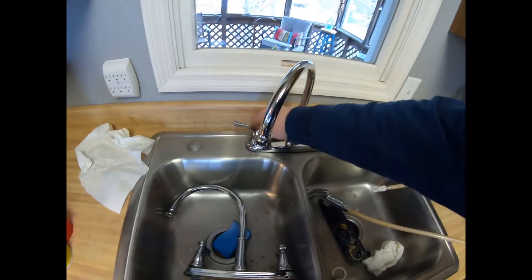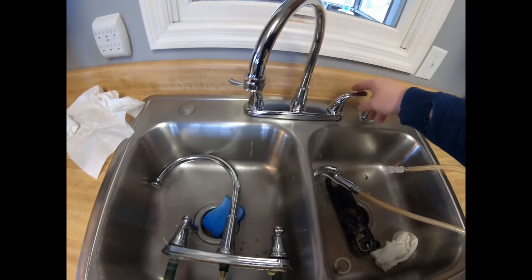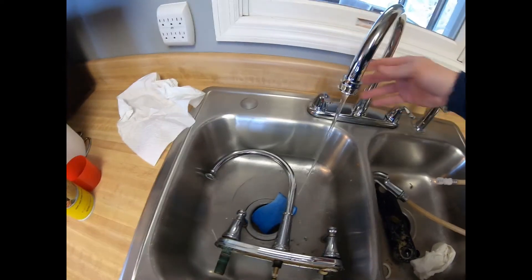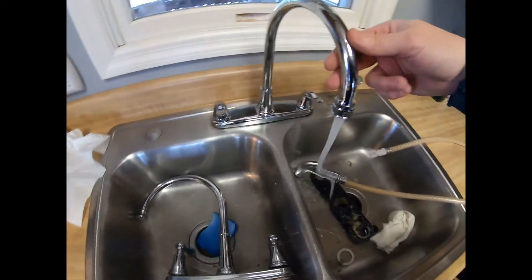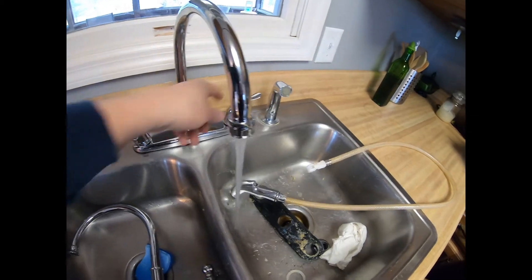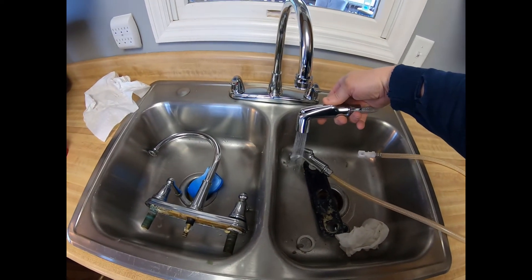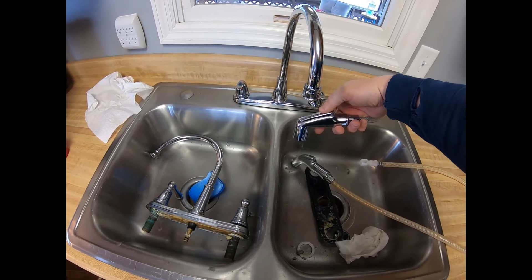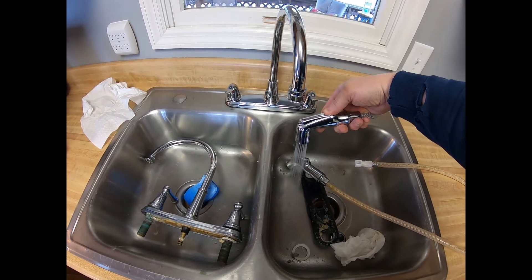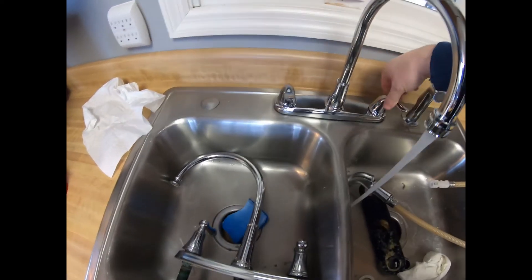These lines still have some air in them. We're going to open the top — you're going to get a big gush of air come out. There — see that? Let me do this side now. Very good — getting air bubbles out of there. Close them, let it build up pressure for a second. Now we're going to get the air out of this line — we want to make sure it builds up full water pressure. Do it several times to get all the air out.